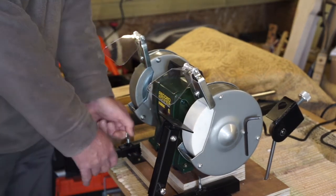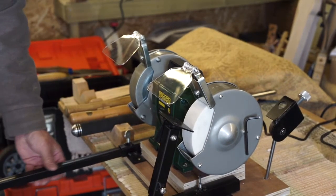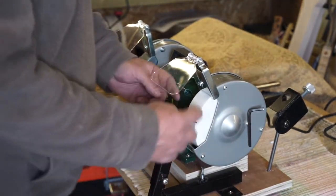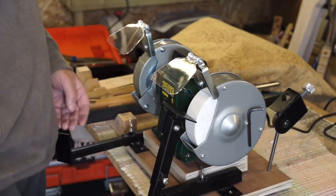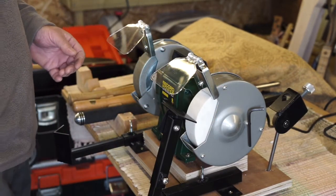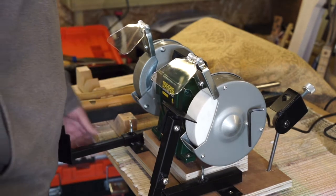The system is made up of two H-frames. The H-frames slide in and out, screwed onto a plywood board, and each system locks into each H-frame with a thumb screw. On the right-hand side there's a pivoting table with a rise-and-fall mechanism — ideal for sharpening scrapers, and you can also use it for straight grinds, your bowl gouge, and your spindle roughing gouge, though I tend to use the big sliding bar for those.